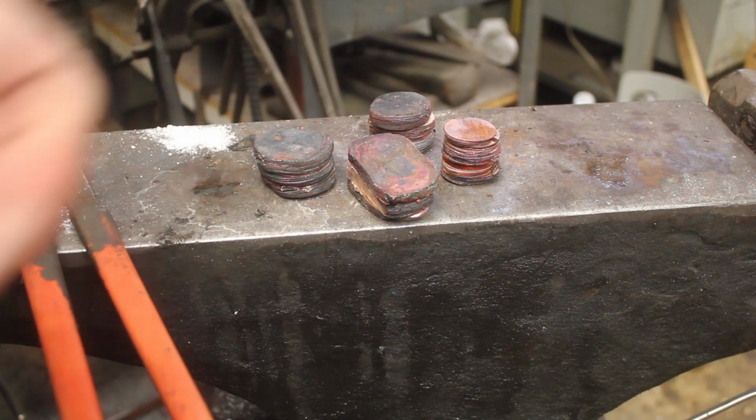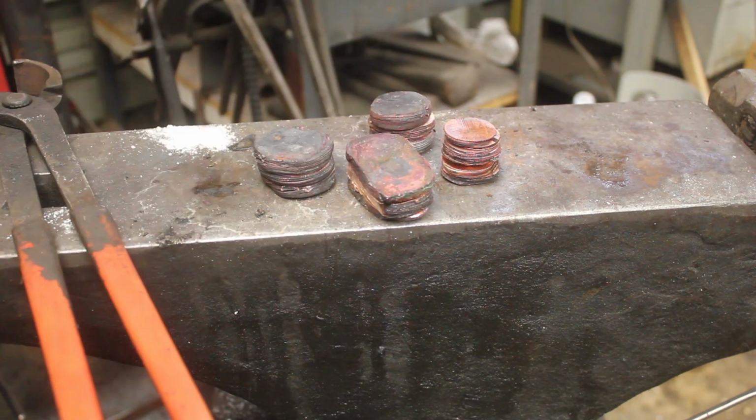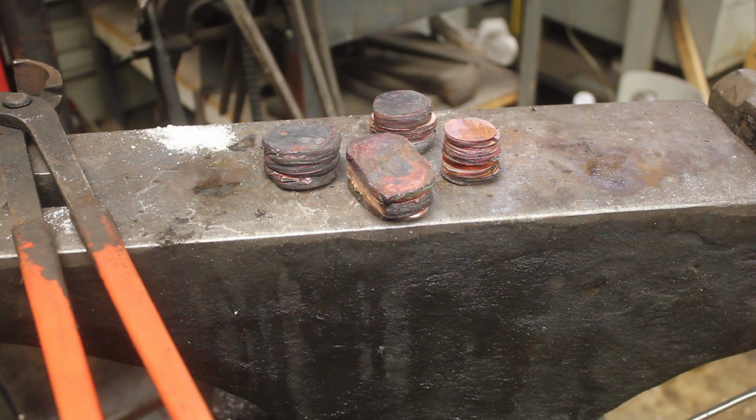We're all cleaned up here. I have all these billets all cleaned up, ready to be forge welded. Once again, I ended up with 4 fairly large billets. So, I'm going to forge these out. There's actually quite a bit of Mokume here. So I'm going to light the forge again and get these forge welded, patterned, and all forged out into usable bars of Mokume Gane.